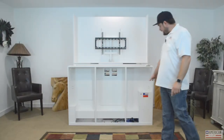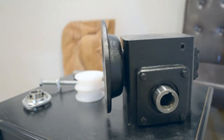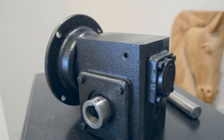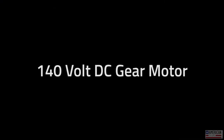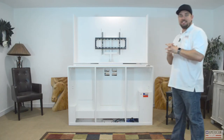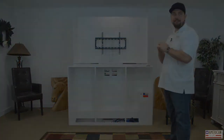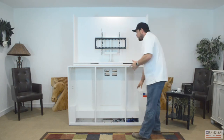There's a gearbox inside this area — right here is an example. It's a 21-pound cast-iron gearbox. We change the ratios of these gearboxes for different speeds and strengths that our customers ask for. There's also a quiet 140-volt DC motor designed to run for a lifetime. It has a noise isolation motor mount, which is why it's so quiet when it operates.